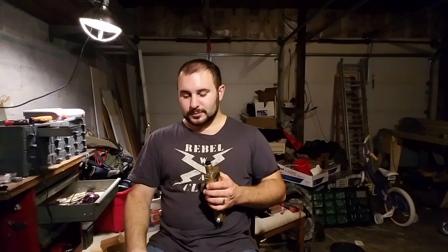I've got a lot of stuff done tonight. I showed you guys the automatic buck boost converter last night — you set it for your output voltage of whatever you want. It takes any input voltage from about 3 to 35 volts in, and outputs 1.5 to 31 volts at a couple amps max.